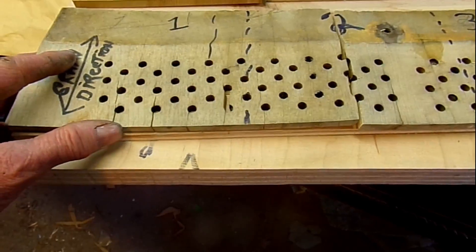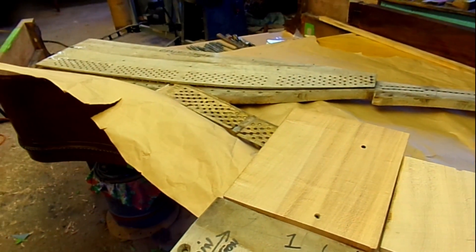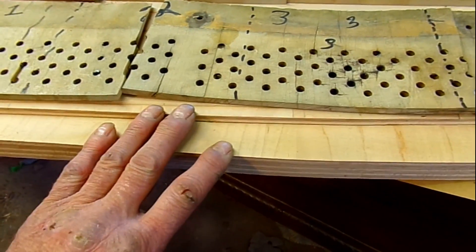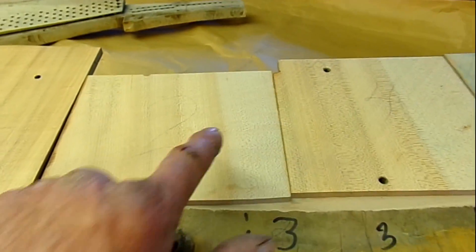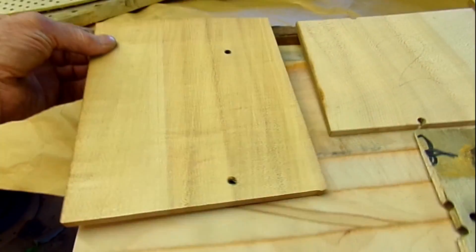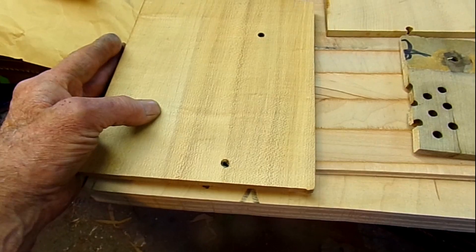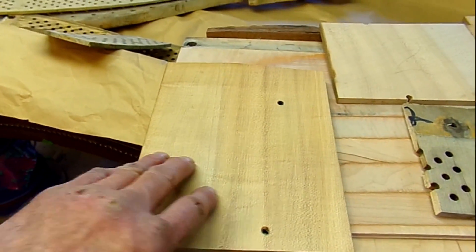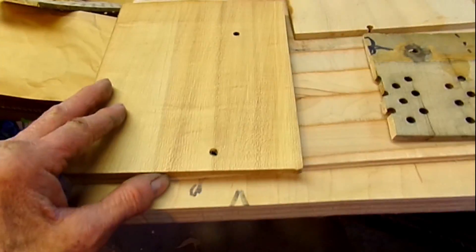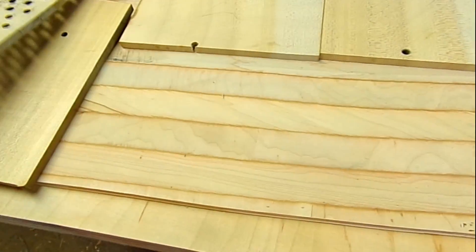I've got to take it down a little more — this one here, on the original over there. That piece is a little bit thinner here, and I don't want to make this any thicker — thinner, if anything — because we want to get more of this end grain cap in here. This fits right here like this. Of course, the hole — who's going to miss that? This is salvaged material. This maple here is like from the 1890s or so. That's some good stuff.